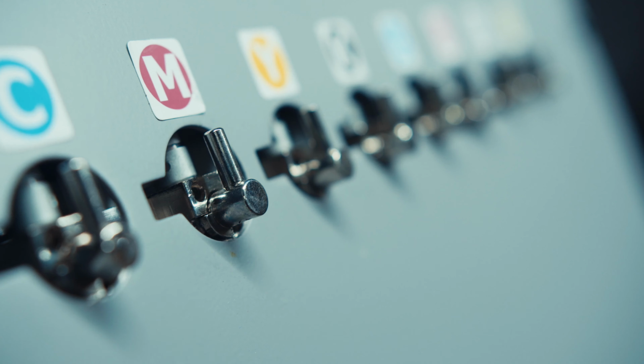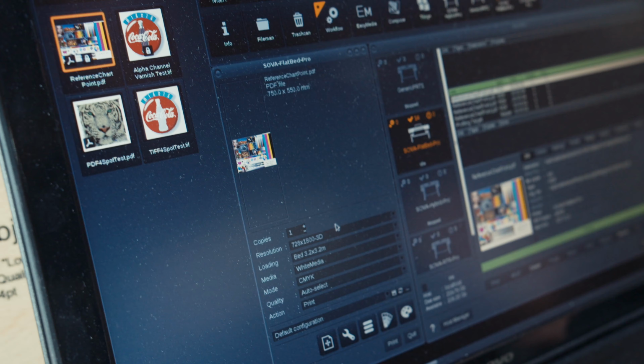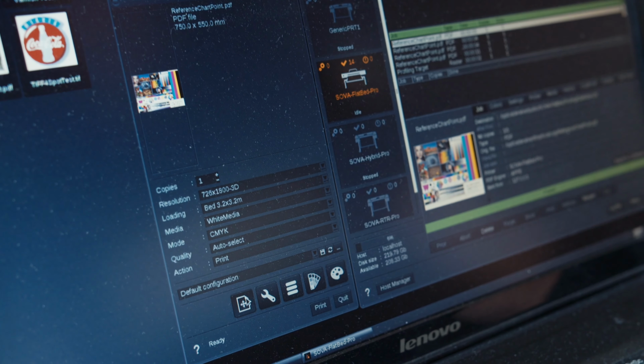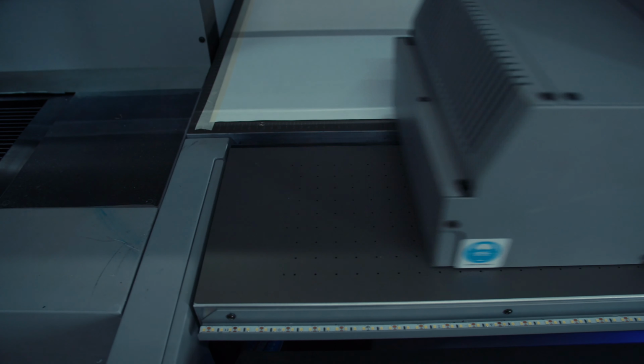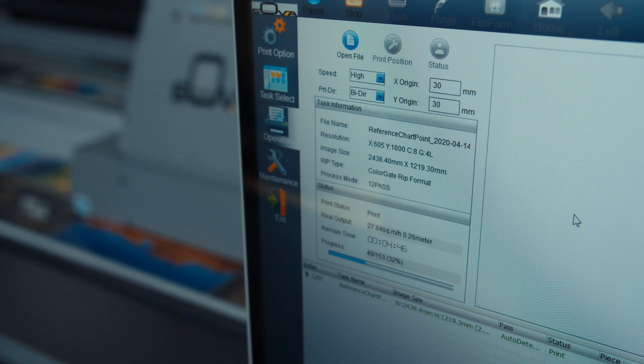The Sova GLYPH 8x4 is the UV printer that satisfies all your production needs. Maximize performance with custom printhead configurations, including options for simultaneous clear varnish and primer. The newest generation of industrial-grade Ricoh printheads, powered by the efficiency of linear induction motors, achieves up to 15 boards per hour with exceptionally high resolution and quality mode.